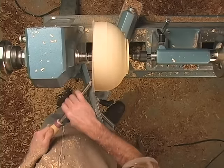Well, when I first get a new tool, I don't know what the factory has given me as a bevel. So I'll test it with this compass, and we'll put that straight edge down the middle of the flute, and it'll read out here on the top. And this one says 45 degrees. That's exactly where I want it. Now to set my platform, I'm going to guess where it is, and I'm going to drop a known angle at 45 degrees and make sure that the bevel and the nose of the tool are in complete contact. That tells me that my platform here is at 45 degrees. That's exactly what I want. You can see that the bevel makes full contact with the grinding stone.